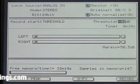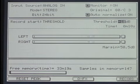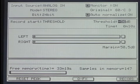Next, we have the threshold level. As you can see at those two little boxes moving back and forth and left and right, as I increase it from the minus up to the positive side, the threshold moves up higher in dB, and they're at 100 dB right there. Here, we're at the lowest, which is minus 56 dB. We set our threshold level so that once our input source surpasses the threshold level, our MPC4000 will start to sample.